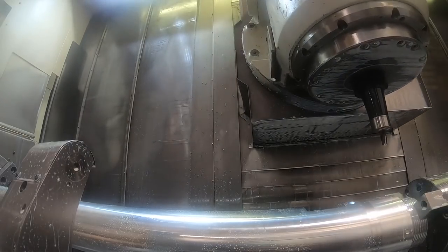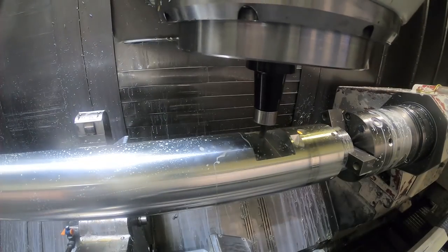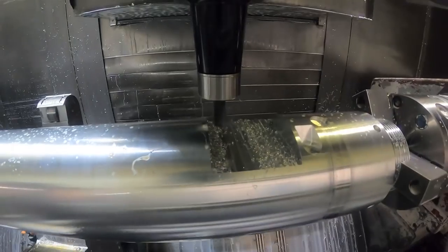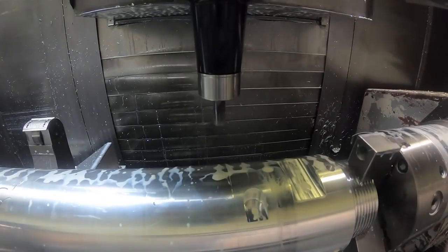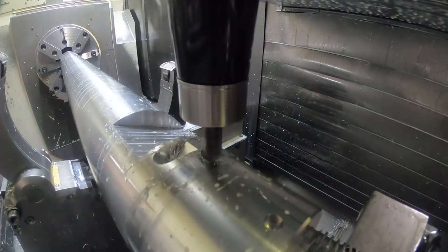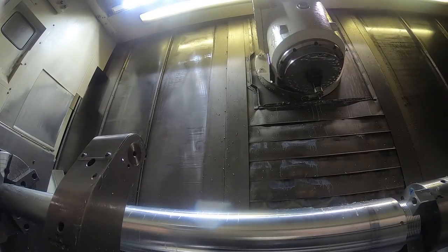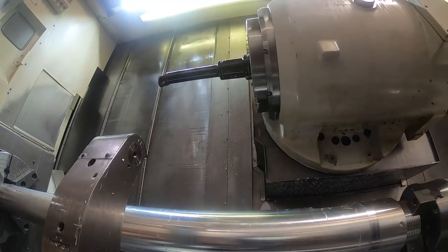And practically every tool in this setup I had to retouch off because I hadn't had them already in the tool changer magazine. So you'll see me doing a lot of that. So here's just the finishing tool of those notches that the bullnose end mill was roughing out. The titanium material, it's better to run a bullnose end mill to rough with, because you lose the points of a regular end mill pretty quickly on the sharp corners. So that's just the counterbores and notches, which you'll see later is where these fittings go into the part.